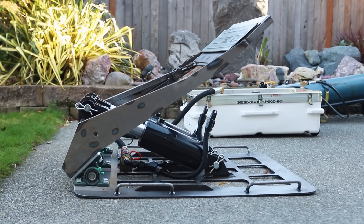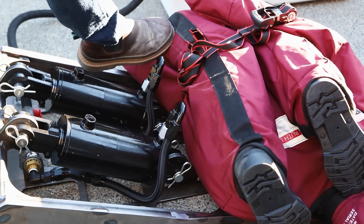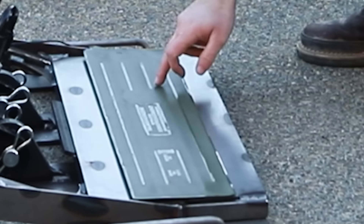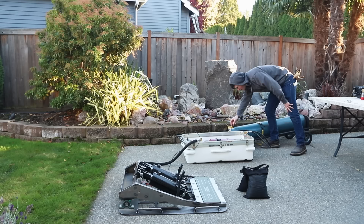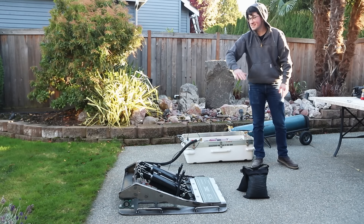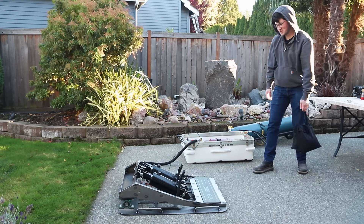After completing Mark 2 of the air ram, I continued to test it by throwing my 110-pound test dummy, because I wanted to see it launch something close to human weight before I got on it. It was a little awkward to fit on the foot pad because of how wide it was, which made it launch straight up. I've been actuating it with a manual trigger, but I want to test out this pressure switch, so I'm going to plug this pressure pad into the control box and toss a sandbag onto it. I've got it set to 350 psi. The system is now armed — any weight that goes on that pressure pad, this thing's going to go off. Three, two, one.